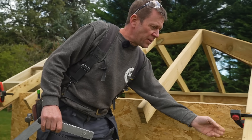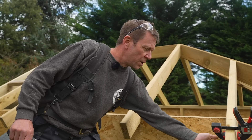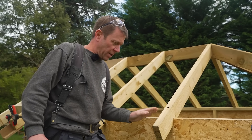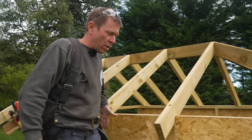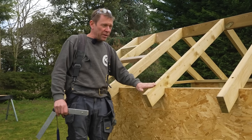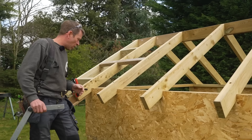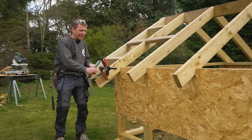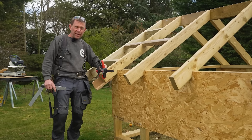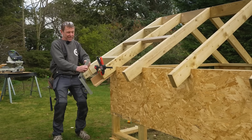I've set the line up underneath using some little brackets I made, based on what a bricklayer uses on his corners. I prefer the line underneath — this line is only going to sag down and if it sags it's still going to run through. Whereas if you put it on top and there's a slight bump in the middle of the roof, you're not necessarily going to pull it through in a nice straight line. With these brackets I can really pull it tight in a way you can't quite do with nails.